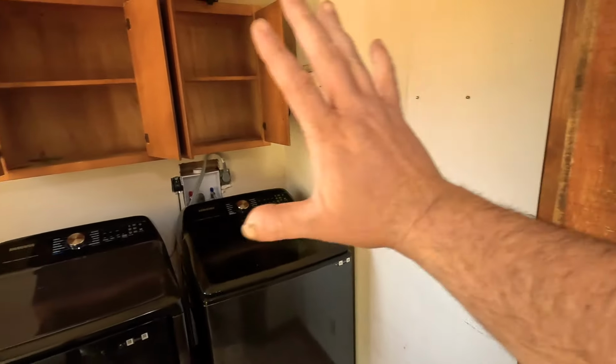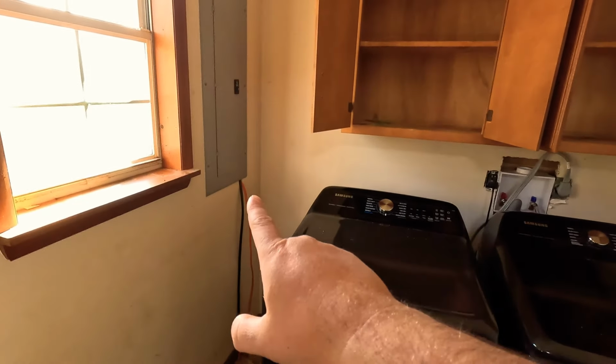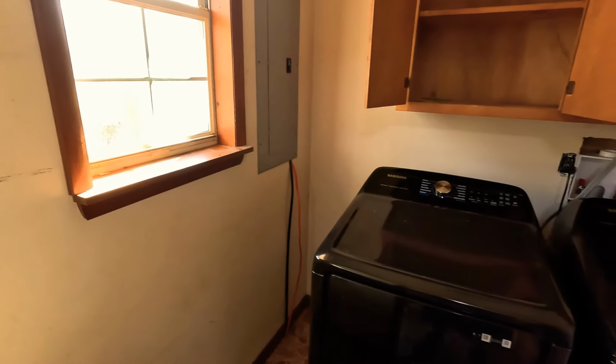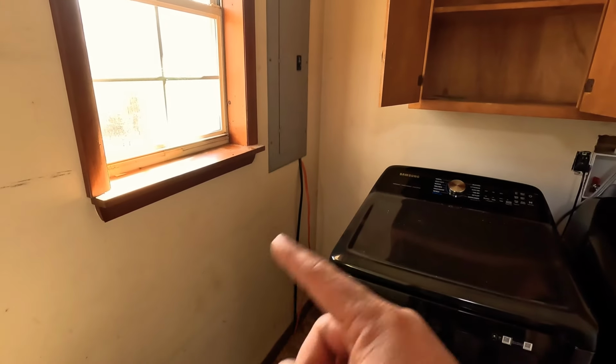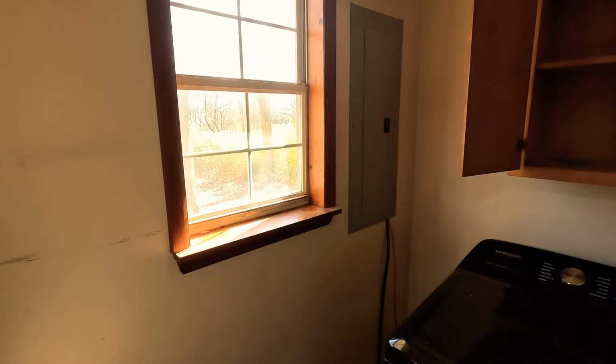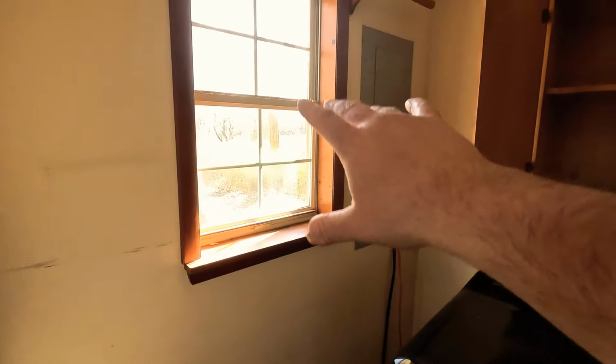Let's go and see what we can. Got one of these old doors here, so this is gonna get ripped out. I'm tearing everything out. We're gonna gut it to the wall studs, because one, I need to put the wire underneath. I guess I could just cut the sheetrock, but we're gonna insulate this with all rock wool. Gonna change the window, but not today, that'll be a little bit later. We're just gonna rip the windowsill out.